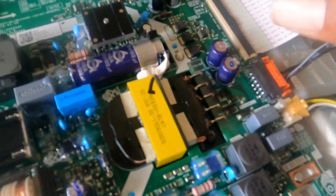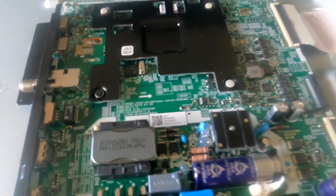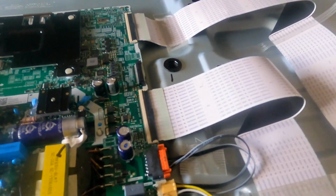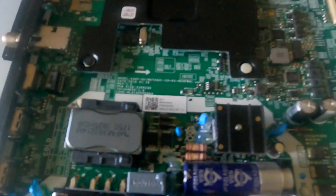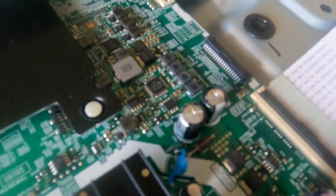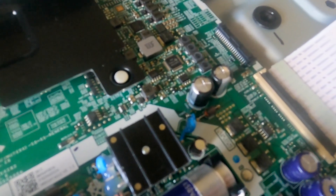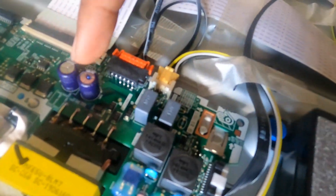It's apparently not getting enough power. I looked at a video and it said there may be some capacitors gone bad, and you can tell they've gone bad by them being swollen. These are the only two that were swollen. I ordered a special kit to replace them, but they sent me the wrong capacitors — it was for replacing these capacitors right here, not the ones I needed.